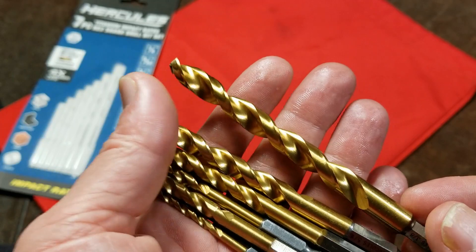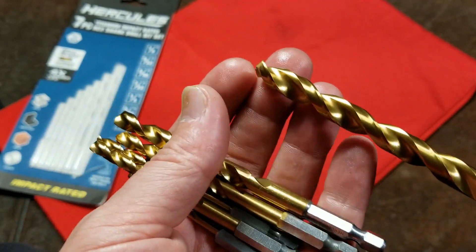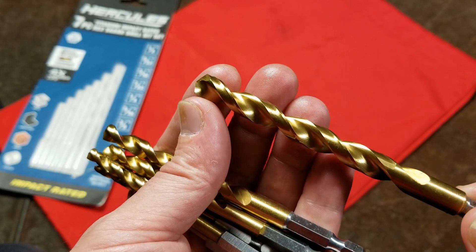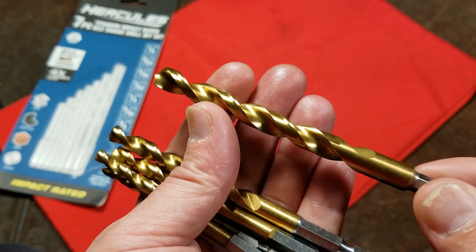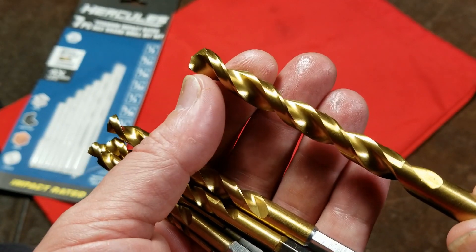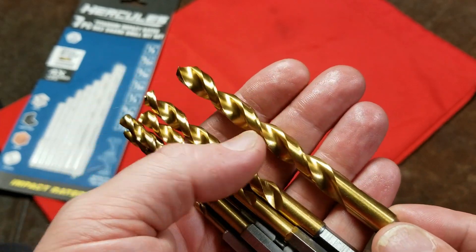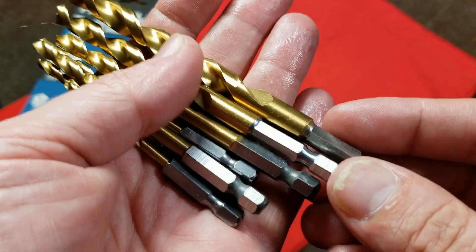Criticisms of this progressive flute design: one, it's often a lot more aggressive than people want, and because it's so thin, especially in thinner cross sections of material, when it breaks through it really doesn't want to clear out the edge and just wants to screw itself in. And of course the second one is that since there is less metal down at the tip of the drill, there's going to be more twisting and a greater likelihood of it breaking — which is what makes it curious that these are impact rated.